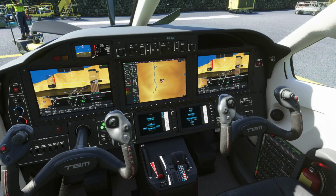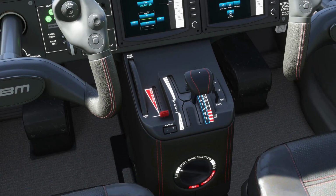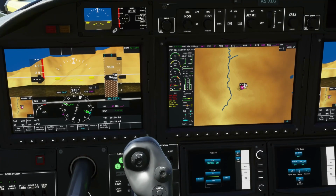Okay, so this is the first position, the low idle position. Now, after 13%, what we are looking for is a 52% mark, and we will also see a white starter light down here, which means that half your igniters have ignited. Our cue to move from low idle to this position, flight idle, is when the NG reaches 52% and also the starter goes off.